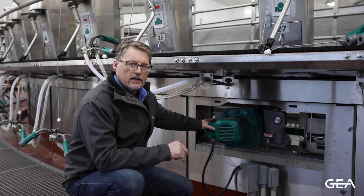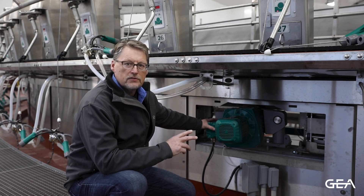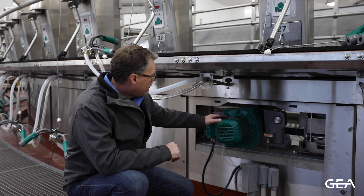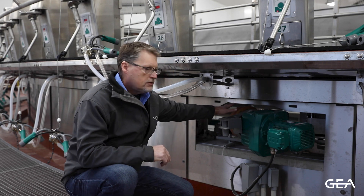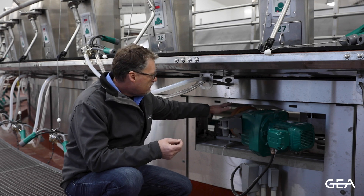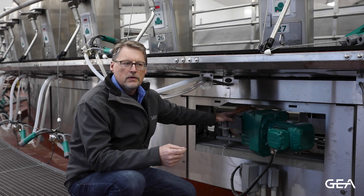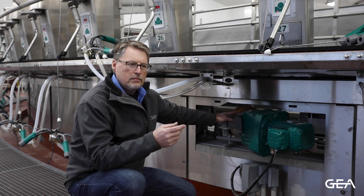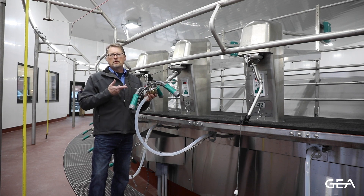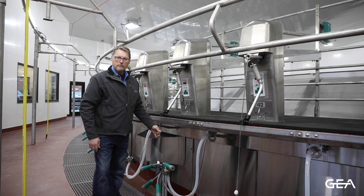One of the unique features on the T8800 series rotary deck is that the drive motors are serviceable and can be inspected from the outside of the rotary. When we take the shielding off the drive, we can swing the motor out with the drive unit on it to inspect the drive wheels or replace if necessary. The way this drive motor engages onto the drive plate is through a vertical integration, which is really different from the T8900 series and competitive products. At the conclusion of milking, the vacuum is turned off and the arm pulls the milker unit squarely off the cow, then the system drops the unit below the deck.